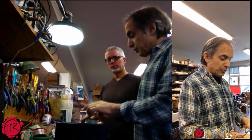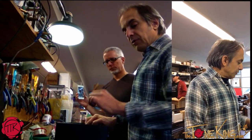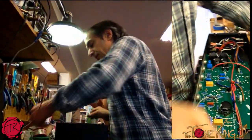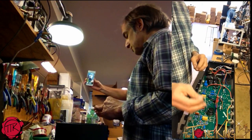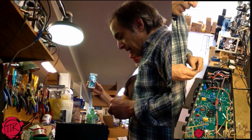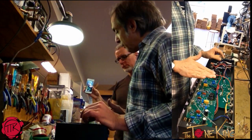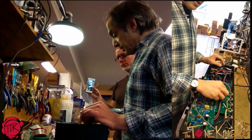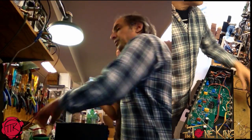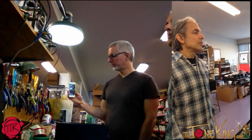What we're going to do is remove these two 470 ohm 2 watt resistors and replace them with these very nice ceramic 1K 3 watt resistors. Then we're also going to change a resistor in the bias supply to lower the overall bias voltage, because EL34s use a lower bias voltage than 5881s or 6L6s. Then we're going to plug in a signal generator, put the amp on a dummy load, and fire it up on the oscilloscope and set the bias.